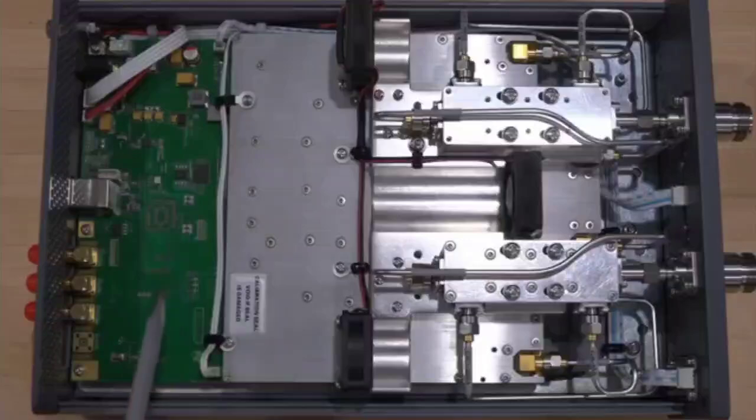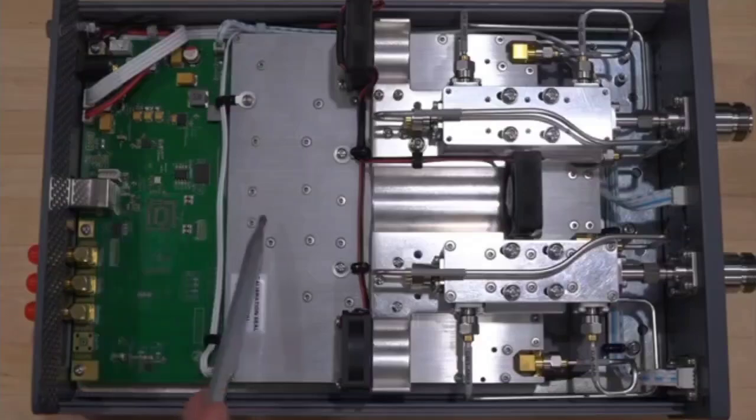The main board at the bottom over here looks like some FPGA or something at the bottom that just interfaces to the USB port and everything else, and everything else is going to be underneath this cage over here. Interestingly enough, there is a reference in port here, which is not populated. I wonder if you could just drill a hole in here, add your own reference, if all the parts are there for it to lock to an external reference or not. I'm not sure why this is not used on the outside, but everything else looks really nice.